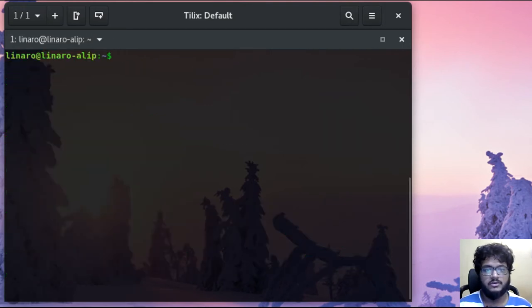Alright, so let's go ahead and create our own Docker image. Now we do need a few more packages for that, including debootstrap. If your internal memory on the DragonBoard is filled up, you might have issues. I have 4 gigs left, so I'm just going to give it a go.